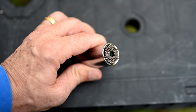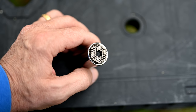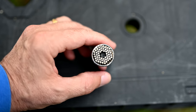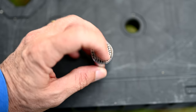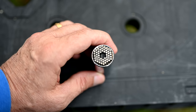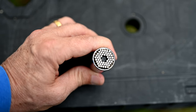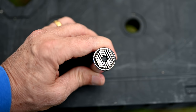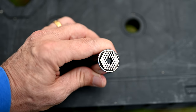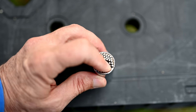If you were thinking of saving three or four bucks by buying a cheap knockoff on Amazon or eBay, let me warn you about the difference. The genuine Gator Grip Universal socket has 54 stainless steel rods, while many counterfeits only have half that number. Because of that, the Gator Grip fits fasteners more quickly and more securely — more rods means a more granular, tighter, better fit.